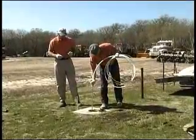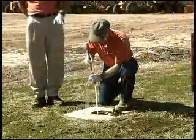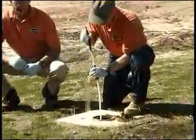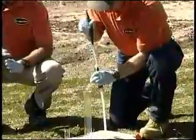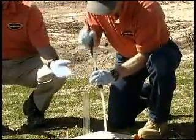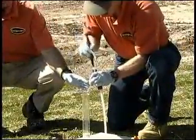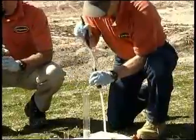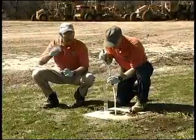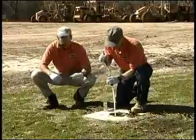Dave's just going to install the pump. There's a screen on the front end for the water to flow into the pump. He's holding the outer tube grip in one hand and the inner tube grip in the other hand, and he's just oscillating the inner tube up and down, which opens and closes the bladder inside the pump. Now we have flow, and even though there's an up-down motion on the inner tube, all of that motion is constrained inside the outer tube down the well.